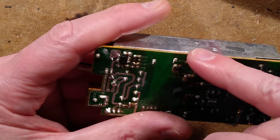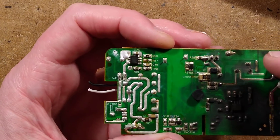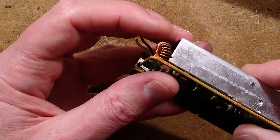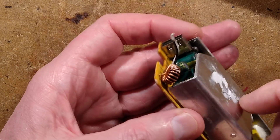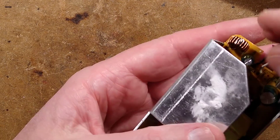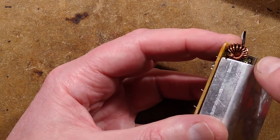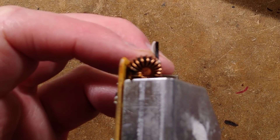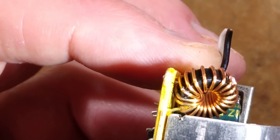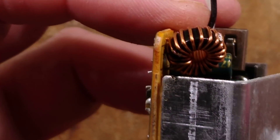What would that have been? That is going over to there — that is probably the class Y capacitor over there. So this is probably the negative connection to the power supply. Let's bend that inductor over and see if it's actually all sooty. Zoom in and you'll see the little telltale splatter of copper there where it's rubbed through on that aluminium heatsink — and that's where the fault current was taken to the circuitry.